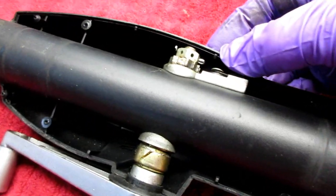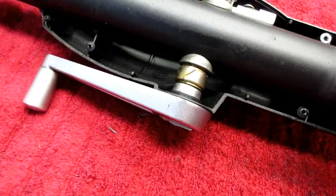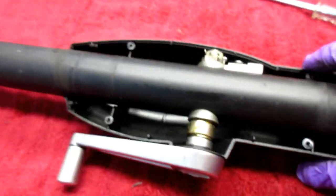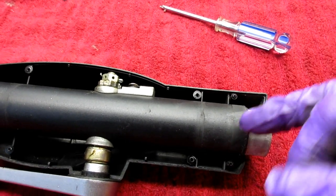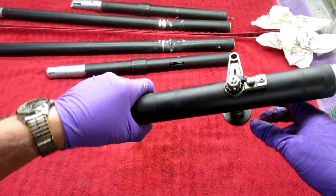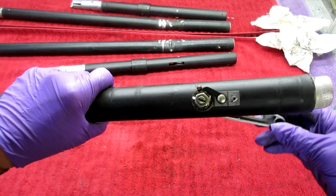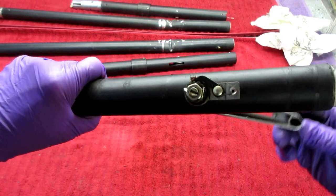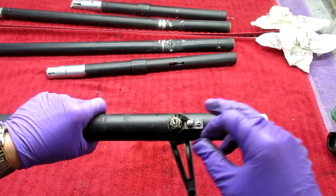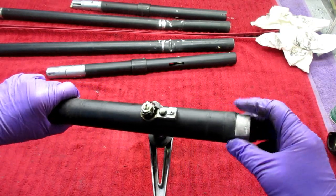So this is what's in here — it's a little ratchet. That's what it looks like, so that when you crank this, it doesn't come back down. And the string is obviously inside there. If you look down in there, there's a little offset pin, and that's how that works. The reason I had to take this off is I have to figure out how to get the new pole — or the old pole rejuvenated — to attach on there. As you're tightening and pulling the umbrella up, the ratchet doesn't let it go back. It only goes one way.